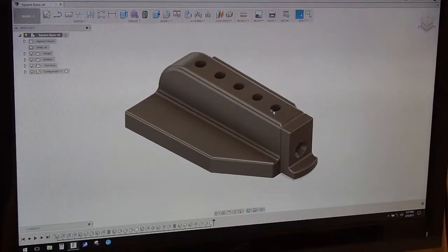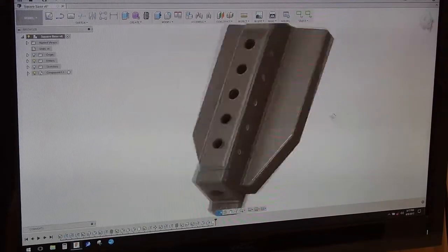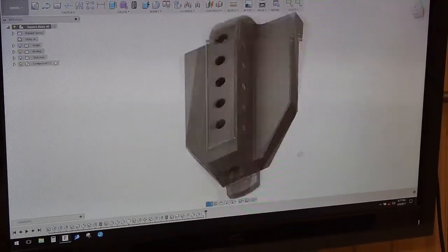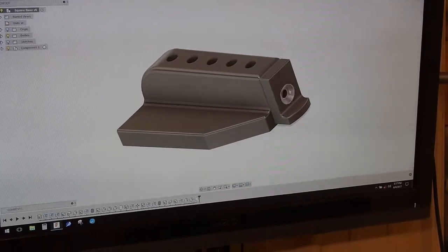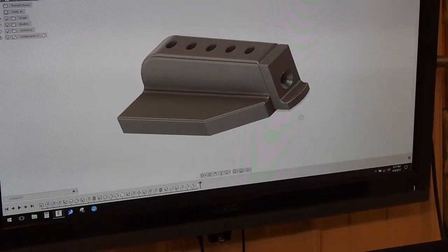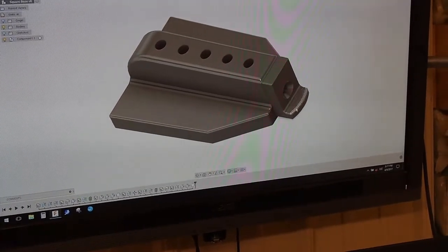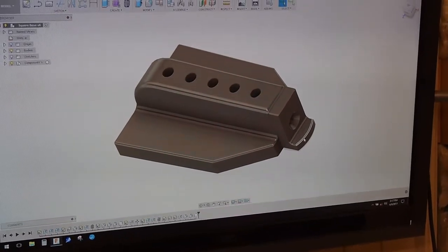I got these different holes, and if I spin this around, you can see I got tap holes where I can tap them in the side. And then I got this little unit that I can bolt on the front that's doweled in. It's got my swing for my radius. It'll have a ground edge on that. I also can make one so I got a V set in there so that we can go up against round parts and check round parts.